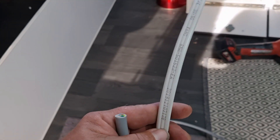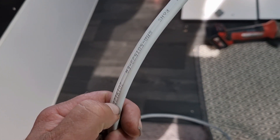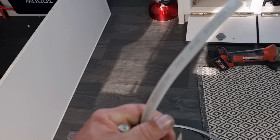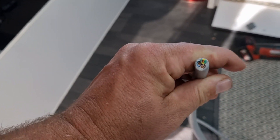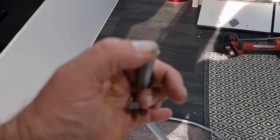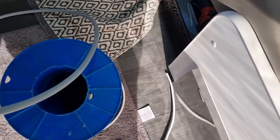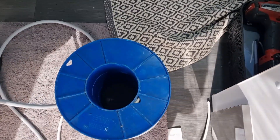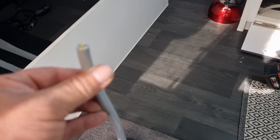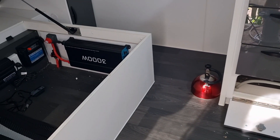I'm not going to run the white house cable even though it handles the same voltage and current — the PVC is not as strong. This cable is a lot thicker and stronger, and it's stranded copper, making it a lot more flexible and robust. Same carrying capacity as your traditional 2.5mm² house cable but much stronger and heavier duty.